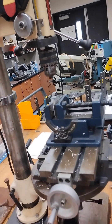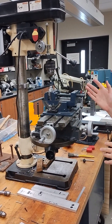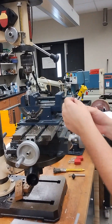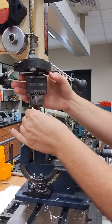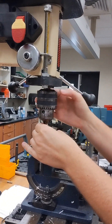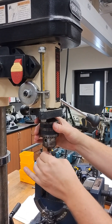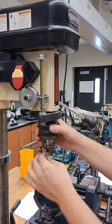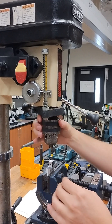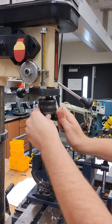There's going to be a deeper, narrower hole, which means it's going to be more sensitive to any error in placement. I've got my smaller drill bit — I'm going to load that into the chuck and tighten this down. Make sure it's in there straight. See that it's still wobbling because it's not in there straight, so straighten it out and tighten it down a little bit more. Get your key and tighten that down a little bit more.